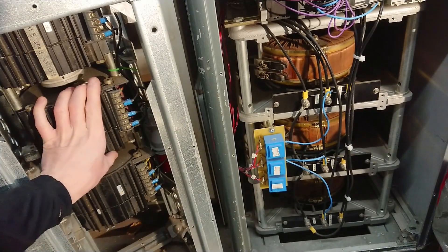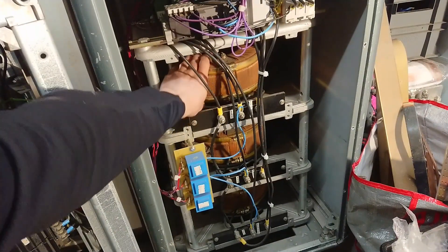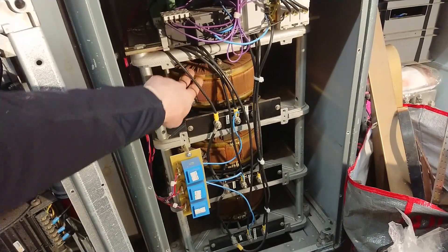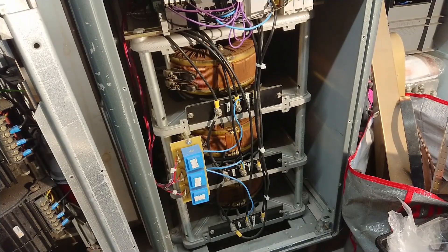Comparing the smaller enclosure over here with these huge raw coils — simply some amazing large auto transformers that can really be abused. This can take a lot of current, up to around 300 percent of its rated current for one to two minutes at a time.